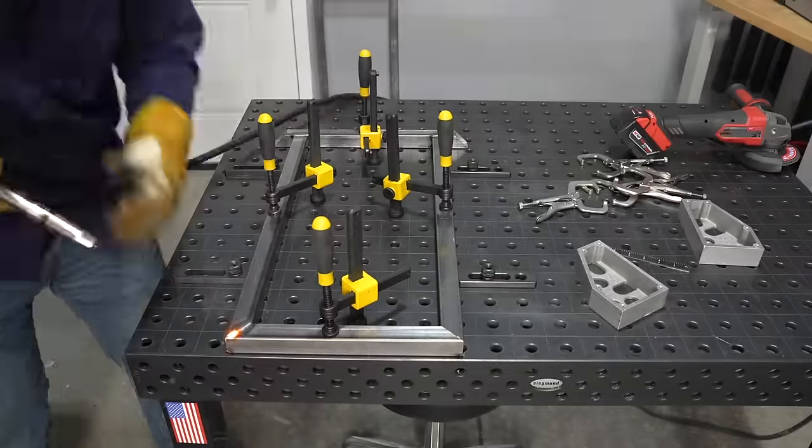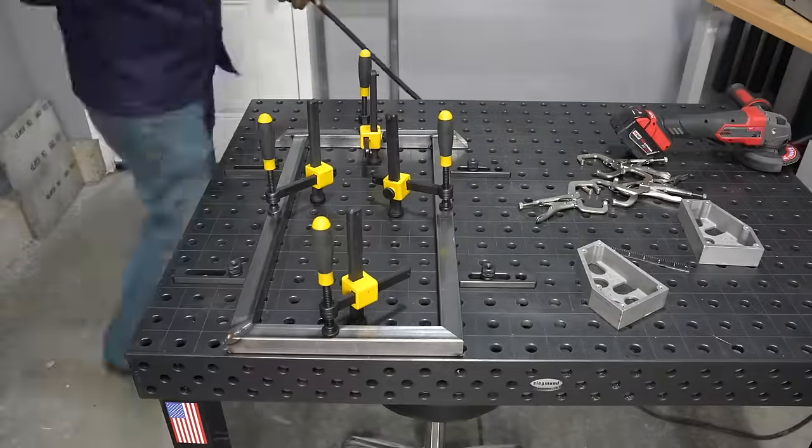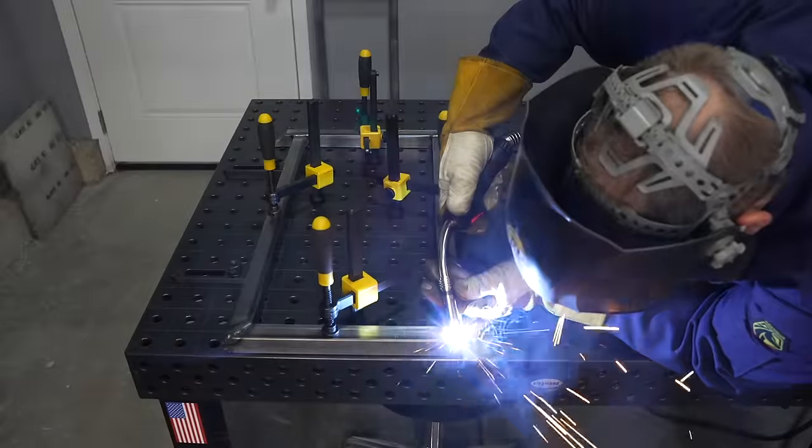When I moved on to these butt joints it was set a little hot so I blew a hole through. A little adjustment and everything will be just fine — it's running pretty good now.